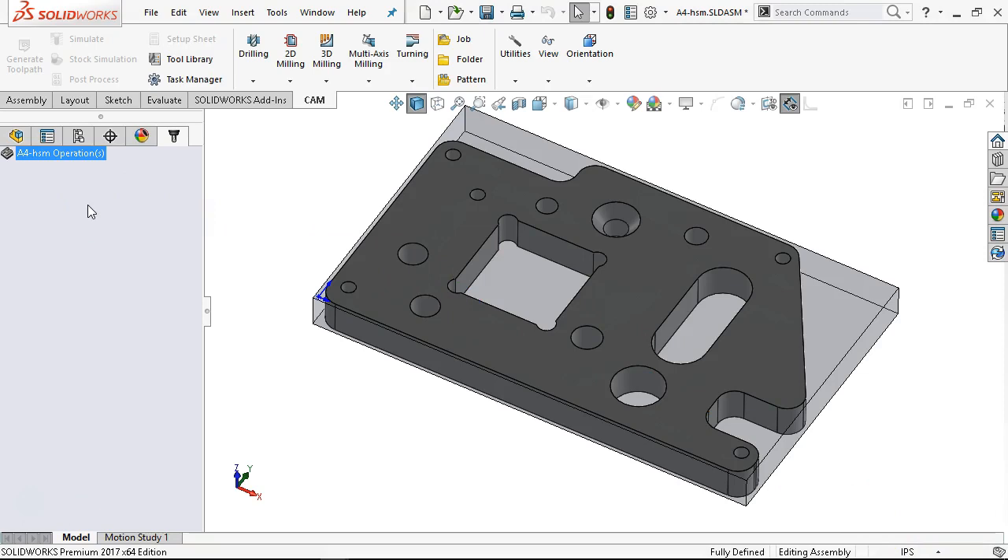We've preloaded. Now each program I'm going to run on that machine, I would go over and grab those four, five, or six tools — however many I end up with as standard tooling. I would grab those and copy, even though I'm not going to use the three-eighths — it has a placeholder. It won't try to put a tool in for tool number two.